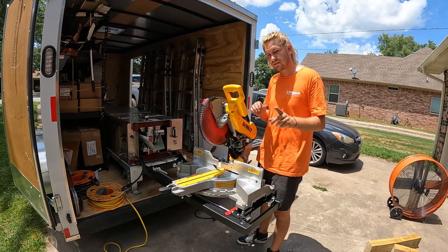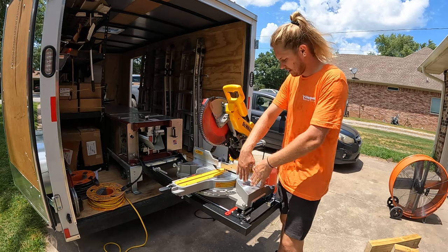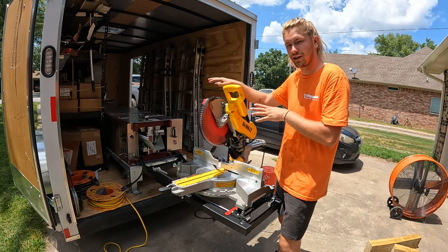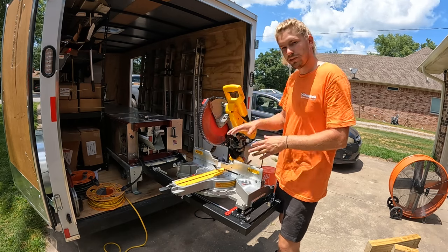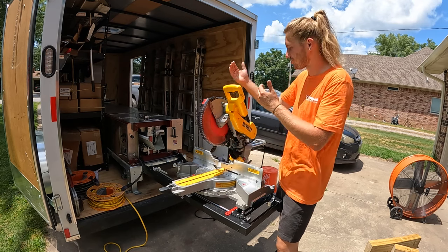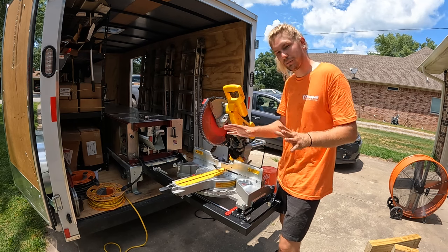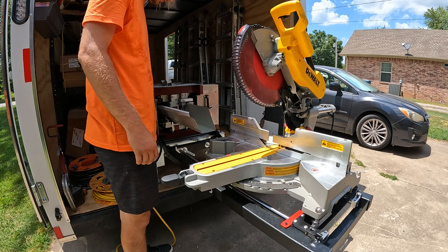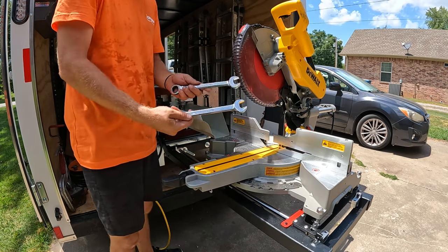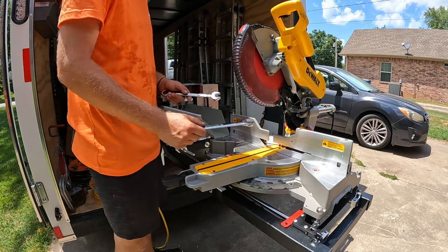The reason why you want to do so is because the gutter on 5-inch will actually sit further up than if it's on 6-inch. So if you align the miter saw based on 5-inch gutter and then you switched it over to 6-inch, you would then have to readjust the miter saw. If you put it on 6-inch, you can just run out 6-inch, adjust the miter saw to 6-inch, and then it'll work perfectly for both sizes. Once you run the gutter out to the miter saw, go ahead and grab two wrenches and start making adjustments on all four fine-tune adjustment bolts.